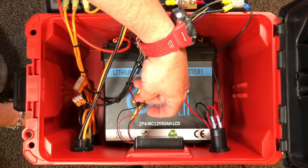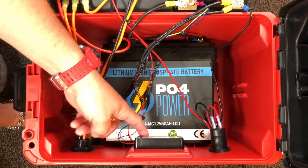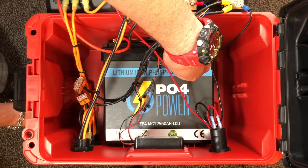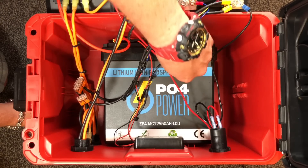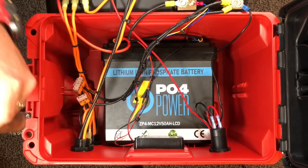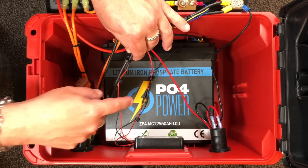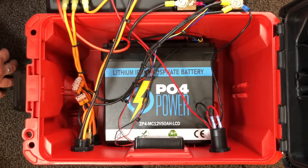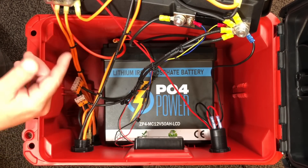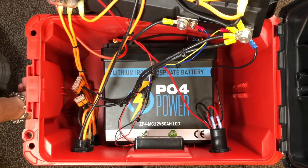Talking about this meter — it comes with two black, two red, and a yellow and a blue wire. The yellow and the blue connect to the yellow and the blue on the shunt. There's a black and a red that connect directly to the battery. I have to splice everything together because the wires aren't long enough — I use a ring terminal from the positive and negative, spliced to the black and red of the smaller wires, and they just tuck in. The yellow and blue wires I had to splice with the black and red and insert them in here. They come with fork terminals already on them. I figure I'm smart enough to build this, so I can trace the yellow and the blue and put them in the correct terminals.